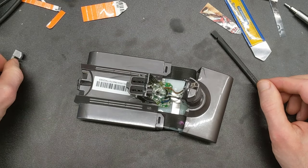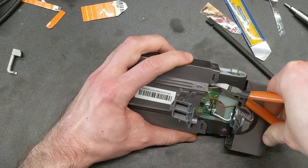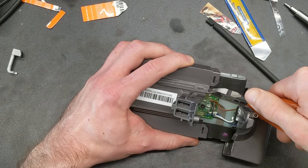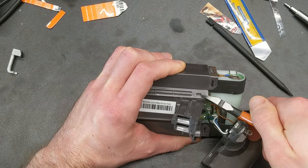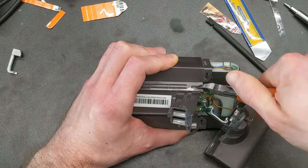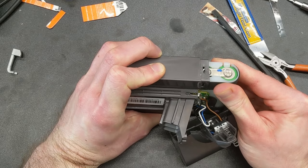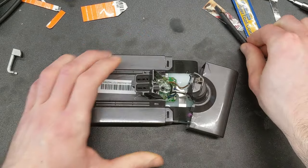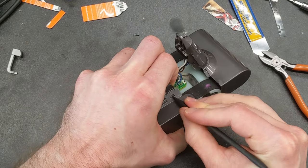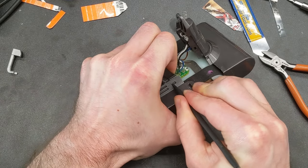It is possible with enough prying to pry the outer plastic shell away around the light pipe to get it out, but I only did that once. I've kind of given up on non-destructively removing this. So what I'll do is carefully — because this is a live battery — clip a channel out of the plastic shell itself so the light pipe can slide out that way. Then on the other side I'll go with the usual prying method, because getting both sides out simultaneously is extremely hard.